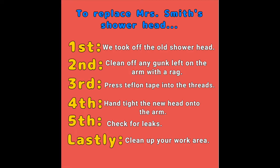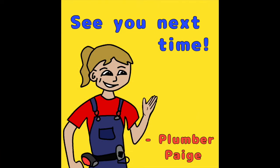To replace Mrs. Smith's shower head, first, we took off the old shower head. Second, clean off any gunk left on the arm with a rag. Third, press Teflon tape into the threads. Fourth, hand tight the new head onto the arm. Fifth, check for leaks. Lastly, clean up your work area. See you next time, Plumber Paige.